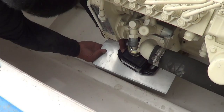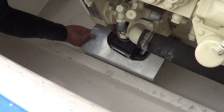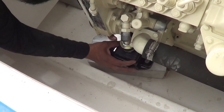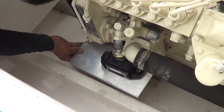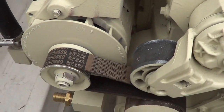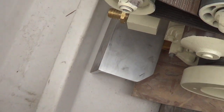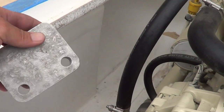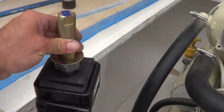We may use M65, but I'm not sure until it goes on permanent. If the angle is up like this and there's a gap, you use Q-cell. If it's minimal, the isolator's rubber part would take a little bit, but not much this way. So we're trying to make them as square as possible to the stringer. On this side it turns out the isolator is going to be a little too far from the stringer, so we're going to use spacers we have in stock to space the motor mount out just a bit - to get the isolator to sit more centered on the stringer bracket.